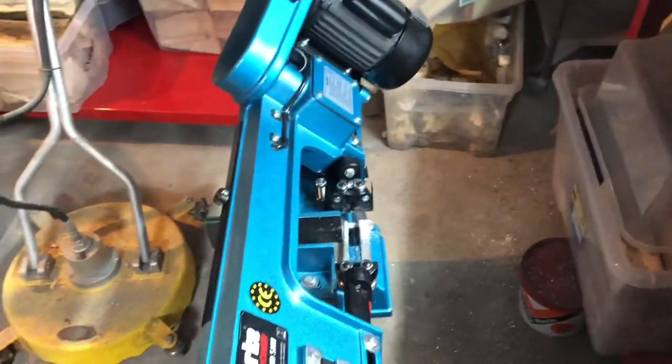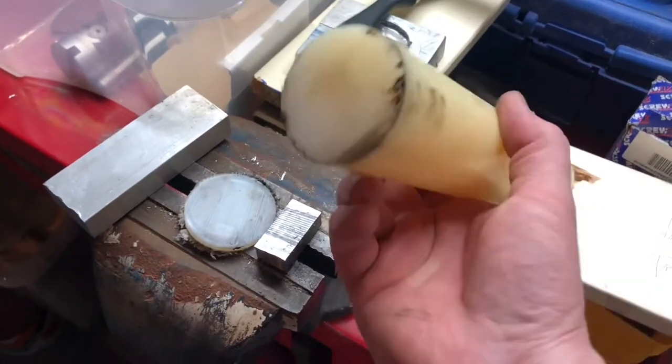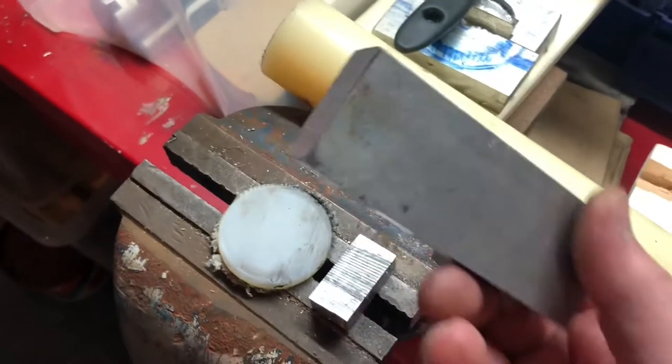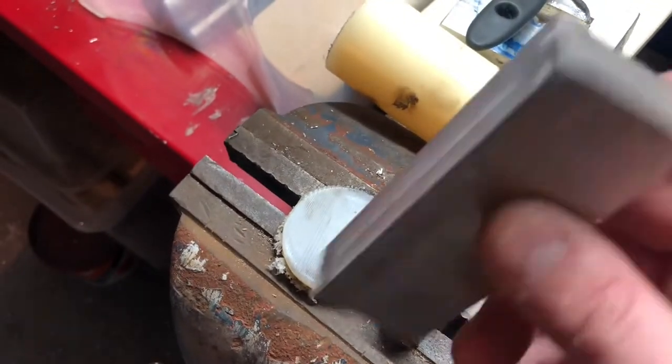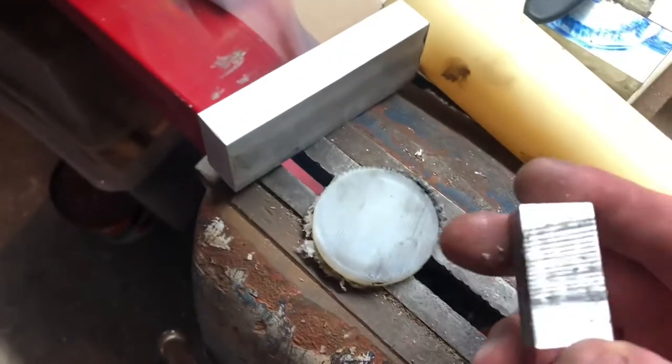It's not bad. The first couple of cuts I made — one on a bit of nylon — that's the side I cut — pretty decent surface finish. That's the cut done with a normal hacksaw, and that one's done with the bandsaw, and it's absolutely square, lovely. There's also a cut on a bit of aluminium bar, and again that's quite a nice finish. Obviously just finish it up on the mill and it would be fantastic — nice square cut on it.